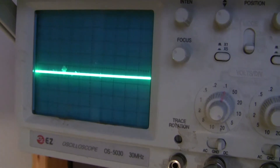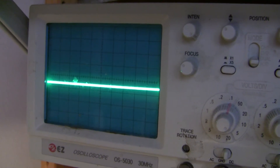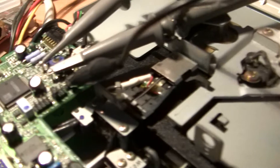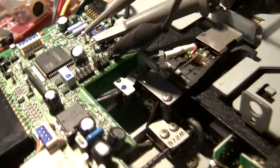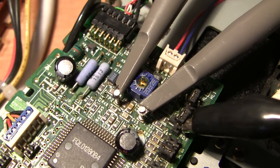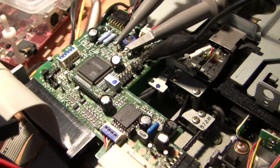This is a C64 disc, and then the unformatted tracks. What's interesting is that on the unformatted tracks, there's no differential signal at all. I don't know why the weak bit stuff appears. I haven't traced out exactly what that signal is, but it's clearly an amplified analog signal off the read head, which is basically what we're looking for, which is handy.